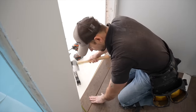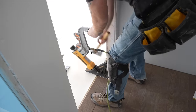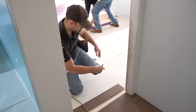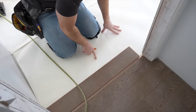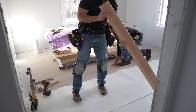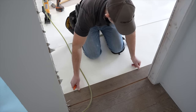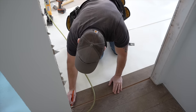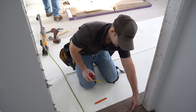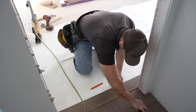When installing hardwood floor throughout a whole house, eventually you'll have to transition from a hallway into a bedroom. I'm going to show a detailed clip on how to do so — we have to notch around the opening to start the next run into the next room. Slide it together, get a longer piece for the starter so it goes past the door opening — it's always good to start with a really straight one here. Get the gaps right and mark the edge of the door. Measure the gap and that's how much we need to rip off, plus a little more for expansion — about three-quarters of an inch on each side.